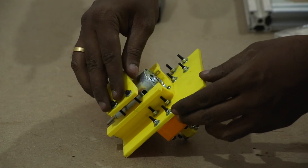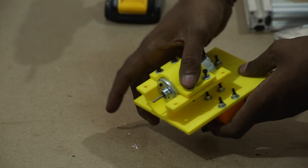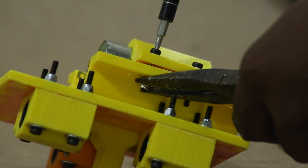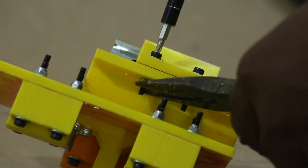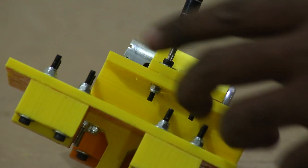I am placing this motor at the top because at the bottom there will be a chuck and then the drill bit. So having the motor at the top will give enough Z-axis height. But if you want, you can move it wherever you want — that's why I have given these extra holes on the sides, so you can attach the cover plate wherever necessary.